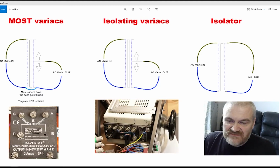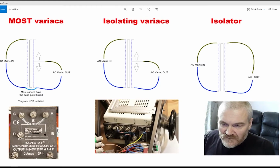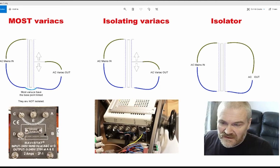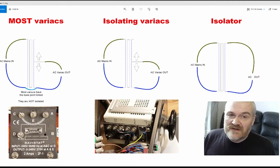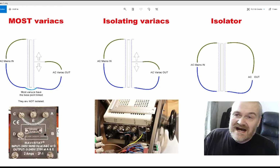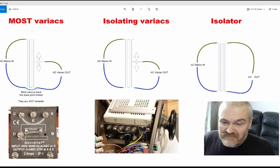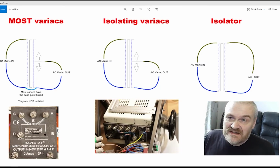Now this is set up to give you quite an adjustable range. In position 4 I get 280 volts out for 240 volts in. By selecting a different tap, you can adjust the range so that you can have a range going lower than 240 and higher than 280. I just find that tap 4 is the best position for me, and that gives me 0 to 280 volts.